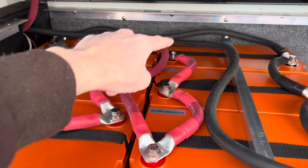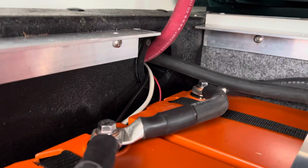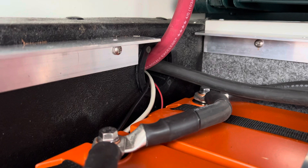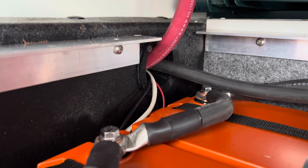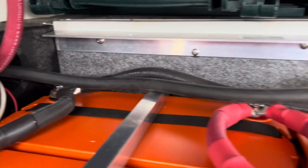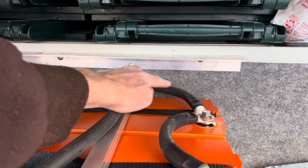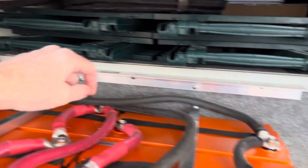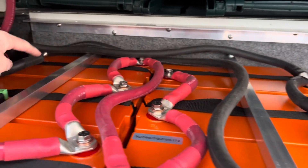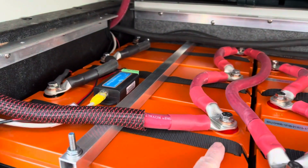The positive starts here and ends back there. The negative comes in from the shunt in the electronics compartment through a rubber grommet in the back — it's a marine rubber boot seal. I put one in the other cabinet as well; it has a zip tie that you tighten down on the boot to weatherize it. You can add sealant too. So the negative daisy chains — this cable is a little longer than the other — comes over here and finishes at the last battery in the chain for the negative, which is the first in the chain for the positive.